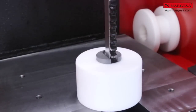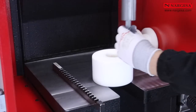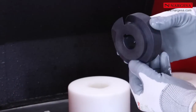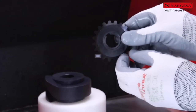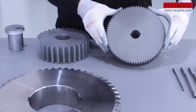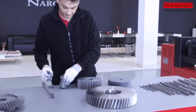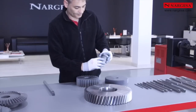We can broach different kinds of materials, including plastic derivatives. In those cases where we want to make more than one slot on the same piece in a specific position, we just need to perform milling work in the bushing in order to insert a centering device.